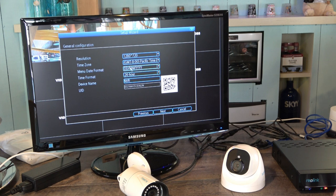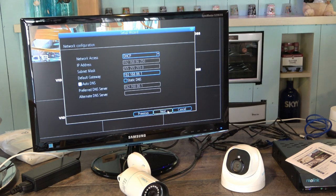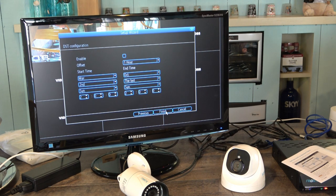I set the password up and we got to select our time zone - Eastern. Month/day/year format, 24-hour format is fine. Device name: NVR. This has a two-terabyte hard drive, so I assume we're going to initialize that. Next up is network info - I don't know if any of that's right so I'll just hit next. It looks like it's picked up my cameras already. We're going to leave email configuration and come back to all of that later.